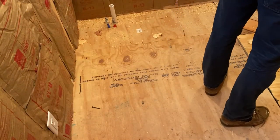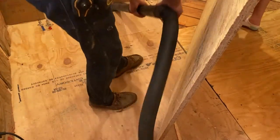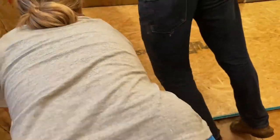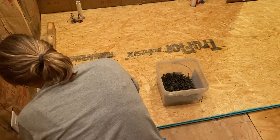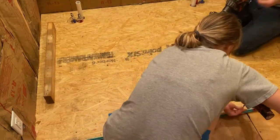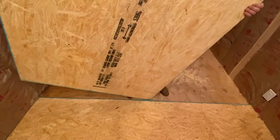This is an important part — before you set the subfloor down ready to fasten it into place, you want to make sure you clean the floor really well. Watch out for any clumps of sawdust, small pieces of wood, or screws that could be in the way, because this will cause the wood to be unlevel and have lumps in it once you fasten it down. Clean it really well and then you can put this down with no worries. Also, if you have any issues with the subfloor getting stuck, grab a scrap piece of two-by-four and pound on that with a hammer or sledgehammer — it'll push it into place. Just like with the plywood, the subfloor will be fastened down with screws about every eight to ten inches.